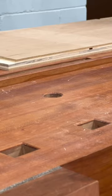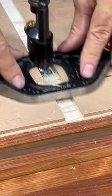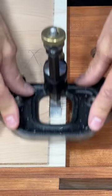To avoid this problem, I use the Humble router plane. With the depth set to the deepest point, I can take a bunch of passes to clear anything that's sitting too high. This can work on rabbets too, if you're careful to keep the pressure on the work side of the plane.